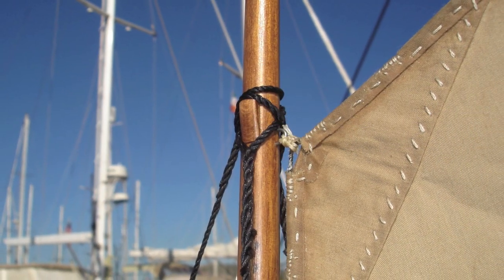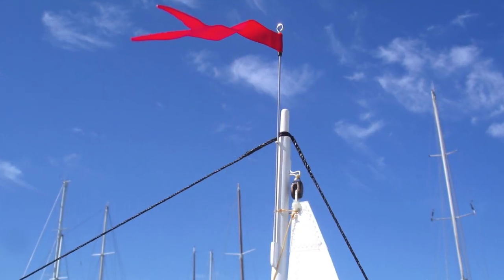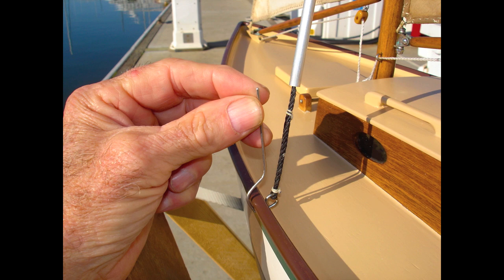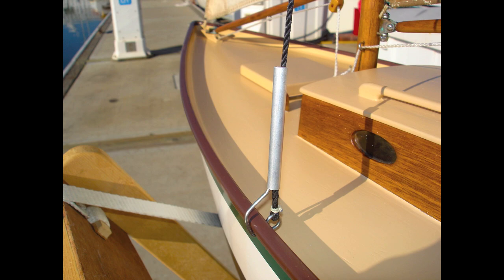The upper end of the twine, being soft, can be made into a loop that can simply fit around the mast. When setting up a rig, connect the stays first before connecting the shrouds — a mast can flex enough to allow a headstay to slip over the top of the mast. My schooner Annie design has a backstay and it can make use of a pelican hook to tension the stay. Gaff rigs can't have backstays, so the shrouds are arranged to pull the mast back, which helps tension the headstay. The shrouds connect to the hull sides with pelican hooks, and that aluminum tubing will slide down to secure the hook.